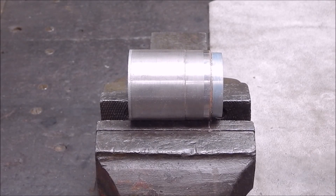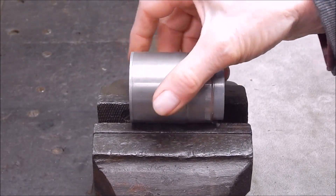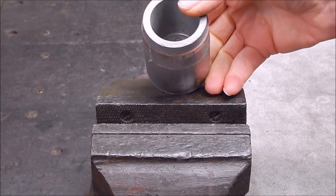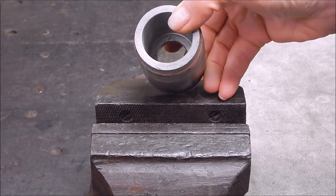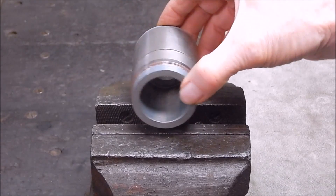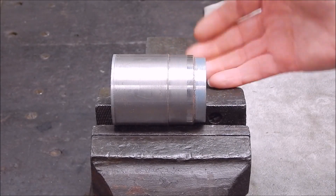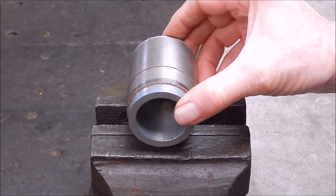To answer this question, you've really got to look at what you're going to be doing with it. You're going to be machining on the outside, machining up to a shoulder on the left or right hand side, drilling a hole, and opening that hole up. Those are your basic functions: outside turning, inside turning, and coming up to shoulders. The lathe can do tapers and all sorts of things, but those are the primary functions.